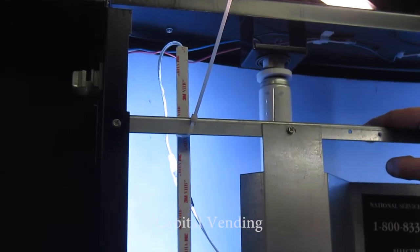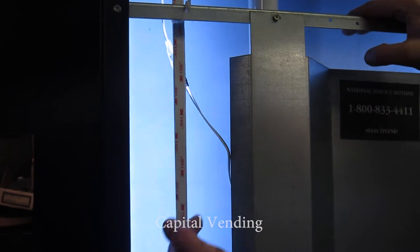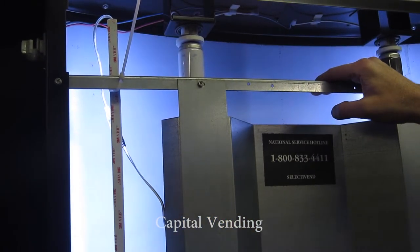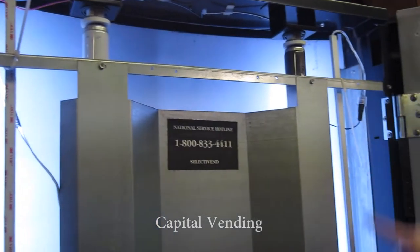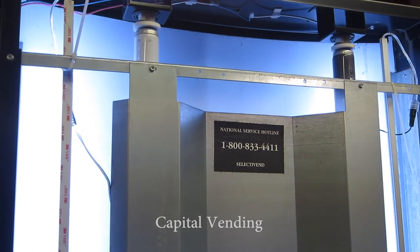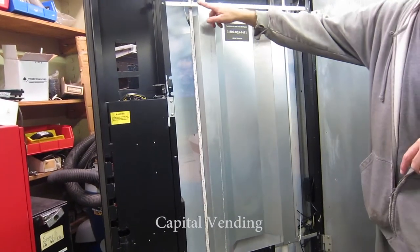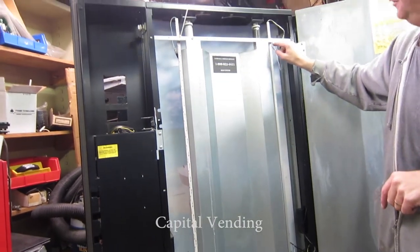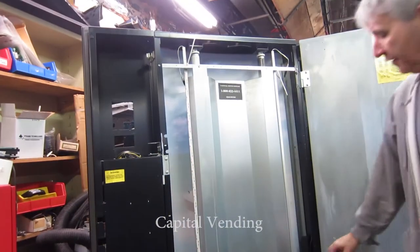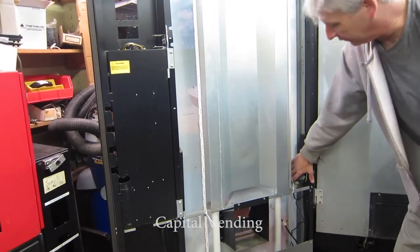After I first powered it, I just took a look at what I had, and with the strips spaced somewhat evenly, the LED light does not shine across this bulb. Again, you could just take out the bulbs, or just space the strips so that the light does not catch them and create a bar shadow on your sign face. The final step of your installation: take a pair of scissors or cutters and remove the excess off the ends of the tie straps, just so it looks nice. All these wires should just be dressed neatly.